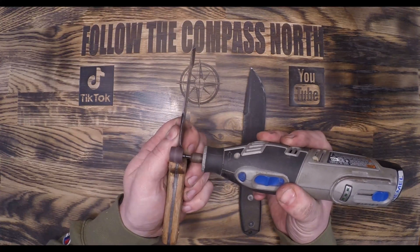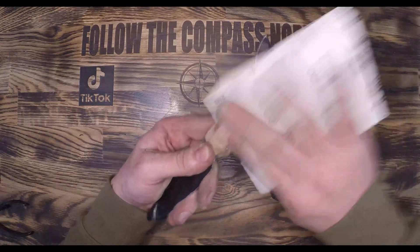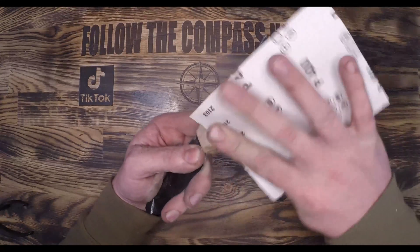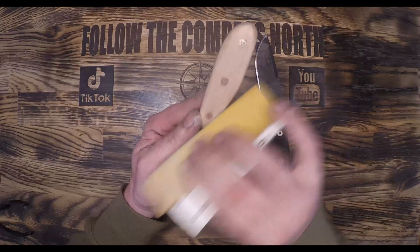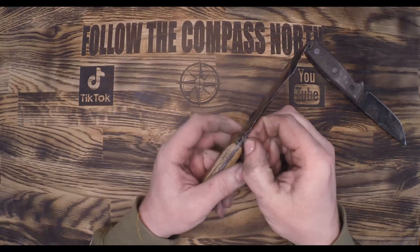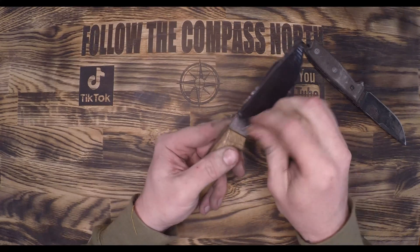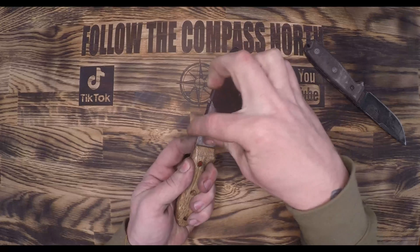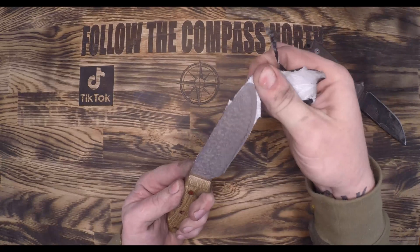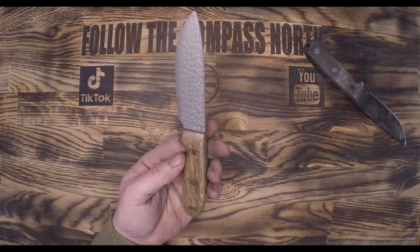I wish I could be more specific but I don't know the numbers. I used the Dremel again to clean up those inside radiuses just because it fits so nicely, and then I'm going to tape the blade up to protect it while I hand sand the handle. I typically use gaffer's or painter's tape for the blade but I didn't find any in my garage and used what I had, which was gorilla tape. It came off fairly nicely with no glue residue left over — probably because I only had it on there for an hour or two while I worked the handle. I like doing this to protect that Damascus etch because you could sand it off and have to re-etch again.